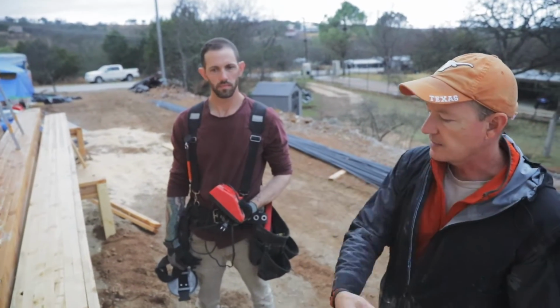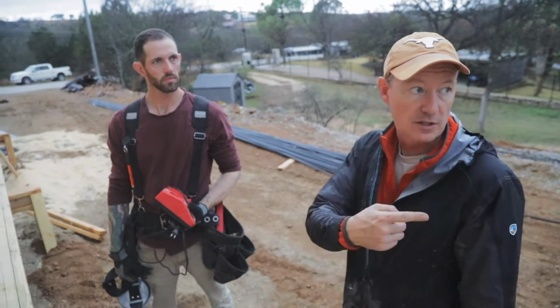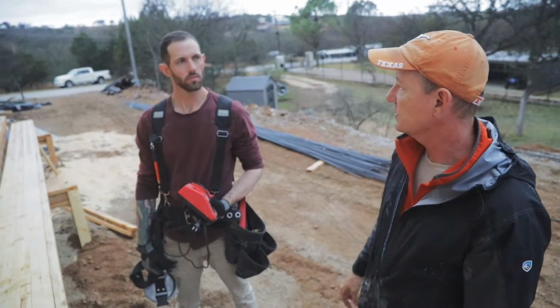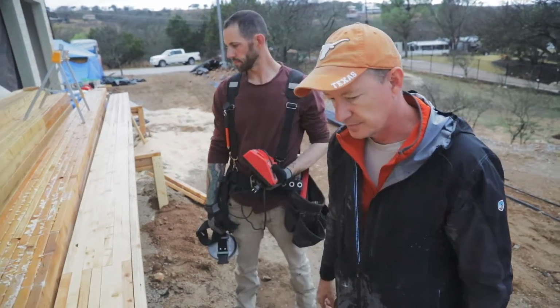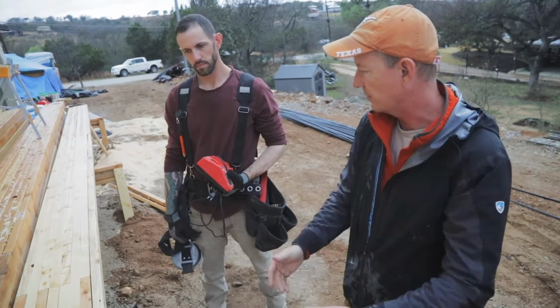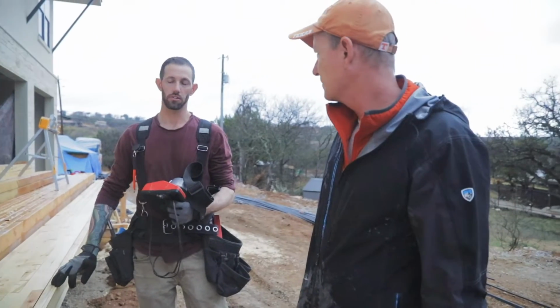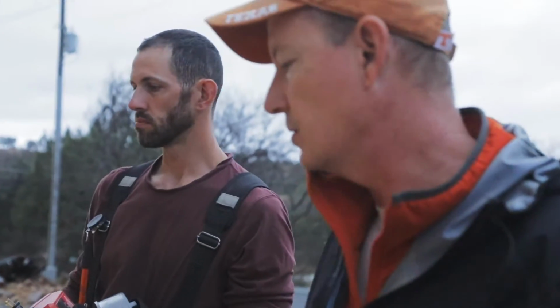And I think if we spray them down, we coat them down good, what that means is that all of a sudden now, when it's under construction for the next 3 or 6 weeks, and it's not dried in, as it rains on it, we won't get the swelling, because this is already swelling and getting out of smoothness. Before we get it out there, we could put like urethane on it. Yeah. So for outdoor. Yeah, exactly. Okay, cool. All right.